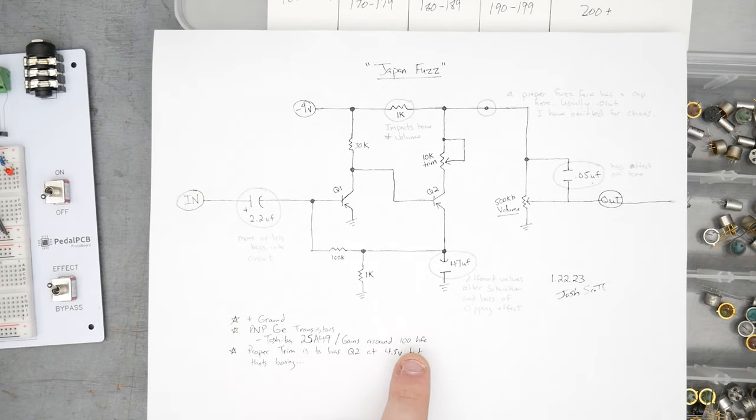It's probably more important, if you want to stick to what JHS put together, to find gains that are similar rather than specifically being 100 HFE. Let's try this one. Same thing, RCA 2N217, 108, that's a little better. And leakage of 92 milliamps, or excuse me, 92 microamps. 92 milliamps would be way too much leakage. 109, 93. So we'll try these. Gains are a little bit far off, but I think it's okay. And we have one Japanese transistor, the Matsushita. So we got our two transistors. The Japanese 2SB173 is going to be our Q1, and the RCA 2N217 is our Q2.